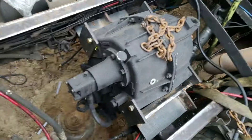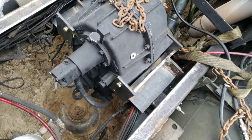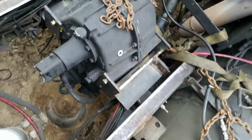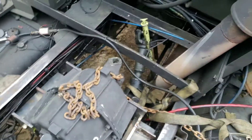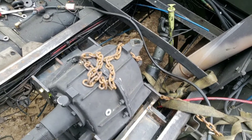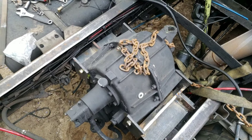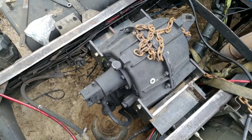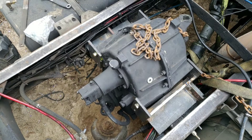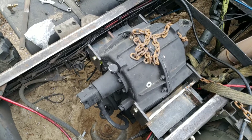This case is also seven inches narrower than the five-ton case, so we had to make some things to make it work. Right now it's just sitting there — I haven't even drilled the holes for the mounting brackets yet. It'll actually be sitting about an inch to an inch and a half higher than it is right now. Overall width with the brackets is 28 and 3/4 inches, and your bolt pattern across is exactly 25 inches, center bolt to center bolt.